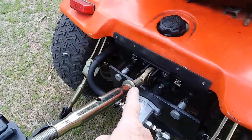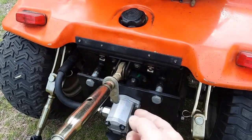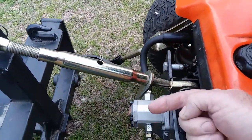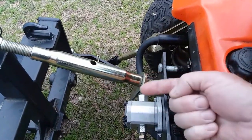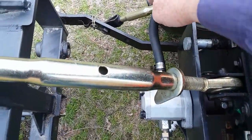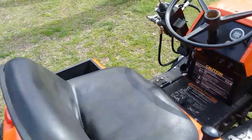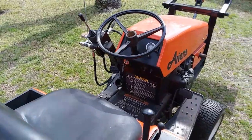You can see that the rear PTO, coming out of the transmission, drives the pump. This tractor turns this way, so when you're looking at the pump from the front, that would be clockwise — so I had to get a counterclockwise pump in order to turn with the tractor. Here's my suction hose, my pressure line, and they go up to feed the spool valve, and from there out to the cylinders.